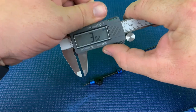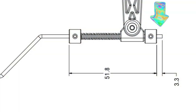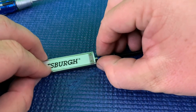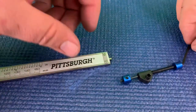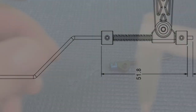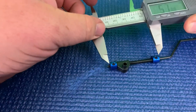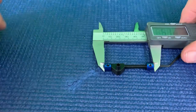Let's go ahead and zero this out. Now we're going to go to 3.3 — lock in our screw. So as you can see, we got 3.3 right here on the edge. We're going to place it against the rod and then just run the collar against it and lock in that set screw. Now we're going to be measuring outside to outside of the two collars, and this is going to be 51.8 millimeters. We now have 51.8 on our caliper — going outside to outside, make sure it's nice and straight, and then go ahead and tighten that up.